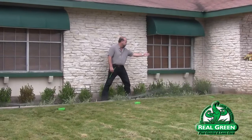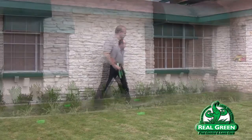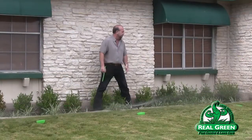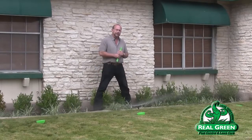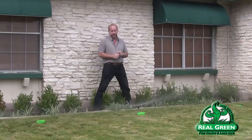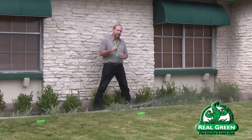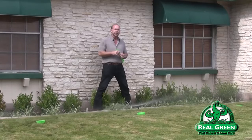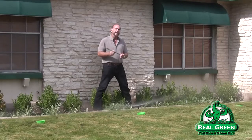That head back there is actually leaning backwards, so it's going to shoot further as well. This lean is oftentimes caused by an irrigation contractor using flexible pipe — flexible pipe is really a no-no. It allows the head to move easily. Soil is dynamic and always moving, so with flexible pipe your head will quickly get out of adjustment and lean one direction or the other. It's important to use rigid PVC when an irrigation system is installed or repaired. I've seen a lot of contractors use flexible pipe for repairs — don't let them do it.